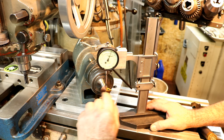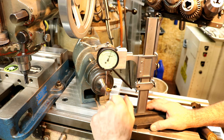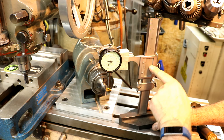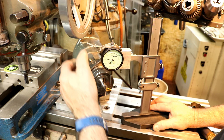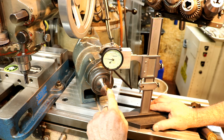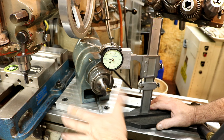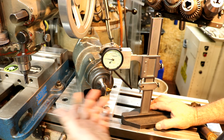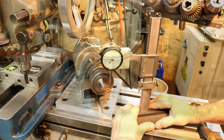We're going to measure that. I would calculate the mill depth for the zero point, calculate that, and subtract it from our reading on the vernier. Reset the vernier to that depth, and then when I go back in this will read zero — or it'll tell me the error, how far off I am, how much I need to finish my milling. I usually only have to measure it a couple of times during the project, so this needs to be handy and easy to use.